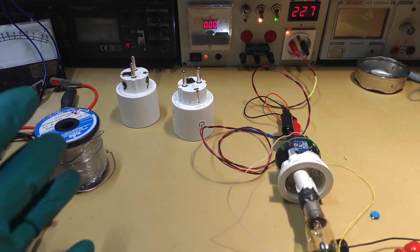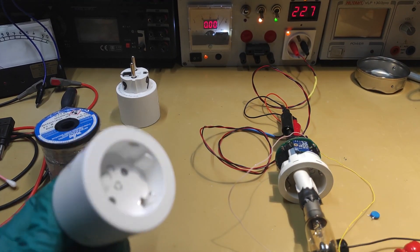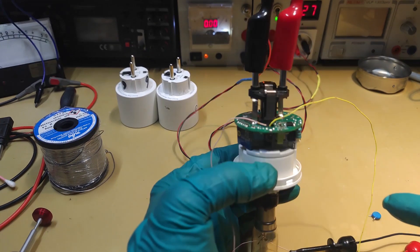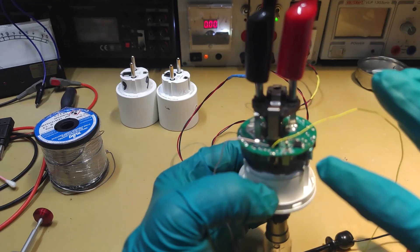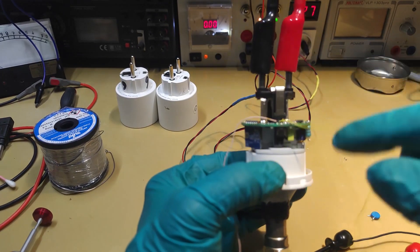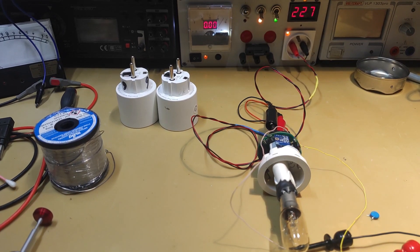It was Alexander again for this repair day. I have a lot of plugs like that to repair now — it is very easy because I know where the problem is. Be aware not to make the same mistake as me, because the integrated circuit is very hard to find on the market. When you desolder an integrated circuit like that, be sure to discharge the main capacitor before connecting a new IC. I hope you liked this video and see you soon.